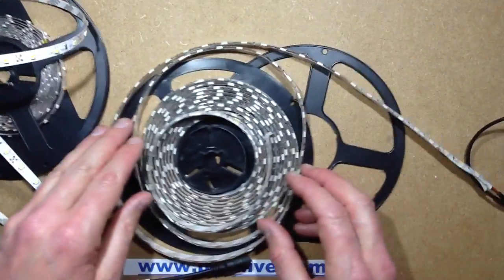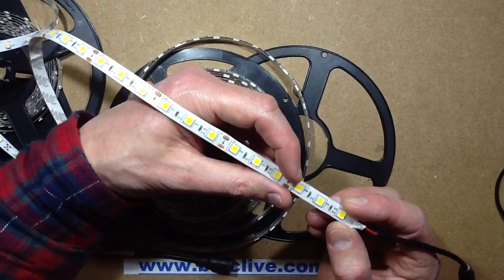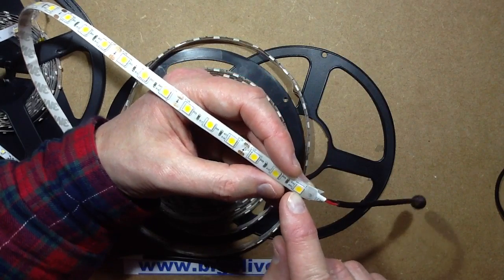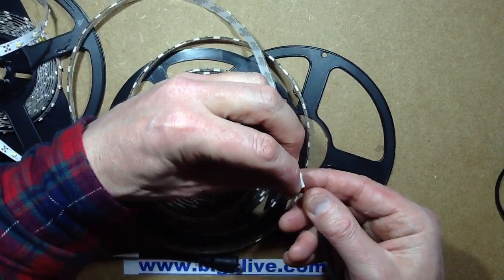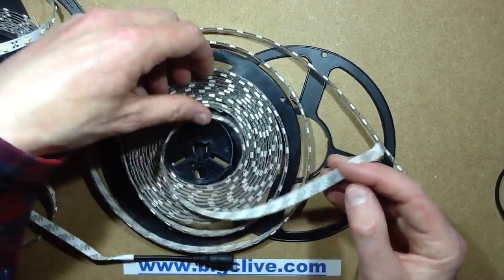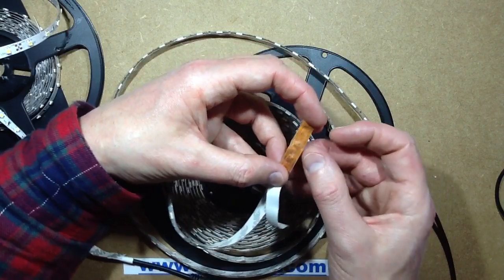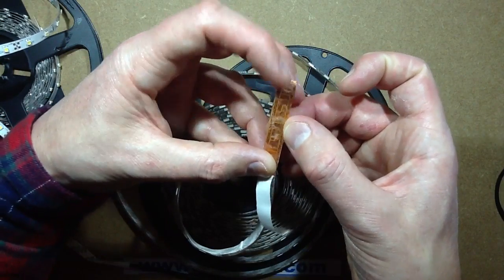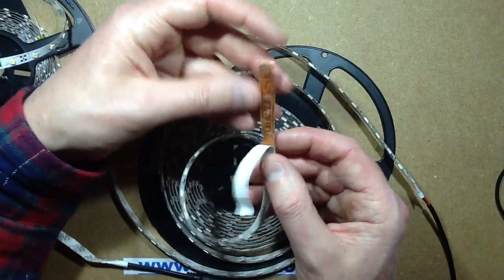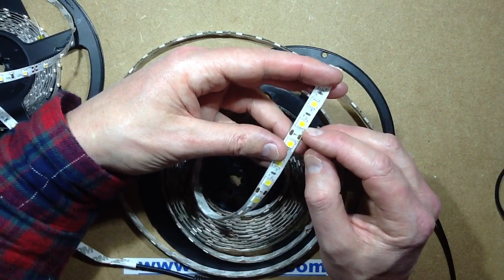The 5050 tape seems to have two resistors. I've not really dug into this too much, but I can guess how it's probably configured. There are three LEDs in each chip, and they're probably wired in parallel. Looking at the back, you get the bus bars down the side, and then the stepped pattern of tracks jumping to the resistors and going through the LEDs. It looks like the LEDs are wired as three parallel LEDs in each device, then a resistor, then three more parallel LEDs, then a resistor, then three more parallel LEDs.